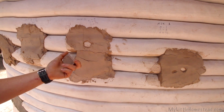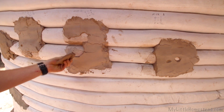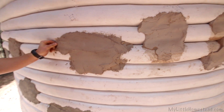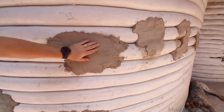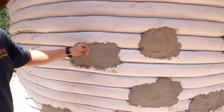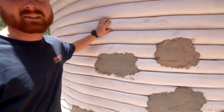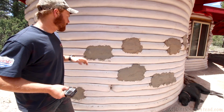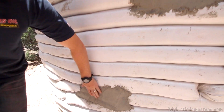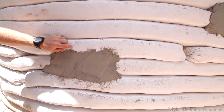We add more sand, less dirt, and then we kind of go up again. And you can see it's getting better as it goes along, less cracking. It sticks a little better to the walls. This is just sand and cement. This one was the ratio that if you were to buy stucco, it would be a 3-to-1 ratio. But it's expensive and it's gonna be unnecessary for this. I think in all honesty, we're gonna be going with this one. It's 3 sand, 1 cement, and half dirt.